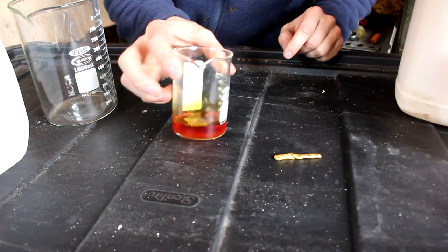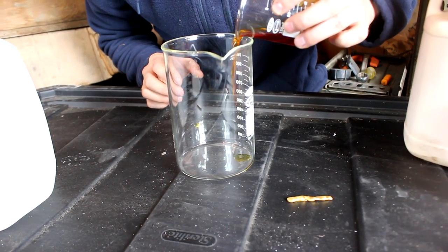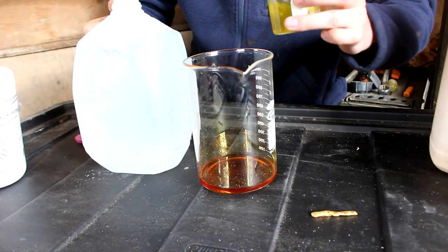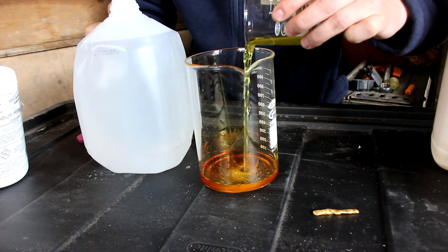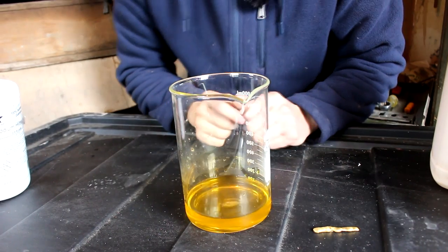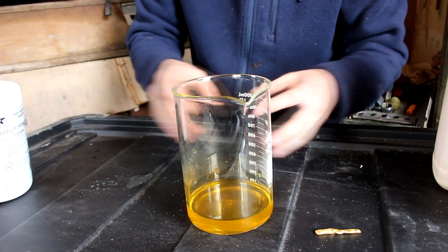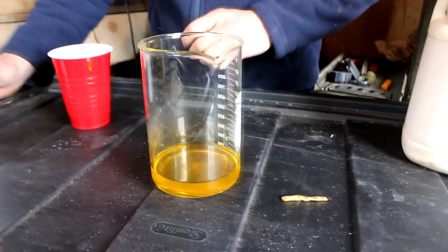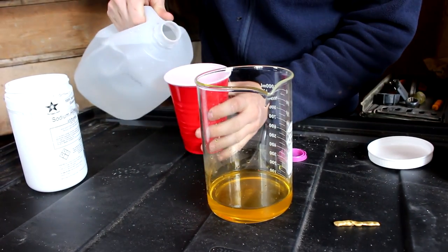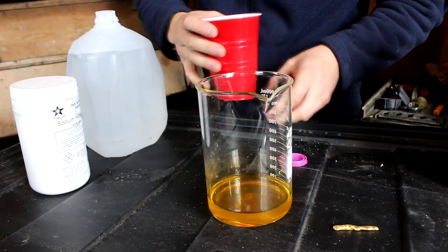Here's the solution — looks like it's mostly all dissolved. I'm gonna pour it into the larger beaker and leave behind all the sand and stuff, then rinse this out with a little bit of water. Now we've got to get the gold into a form that is usable for electroplating. I could electroplate with this, but it would form gold that wouldn't be a flat layer — it would just kind of bunch up into gold crystals. So I need to convert this into a cyanide solution, and one way to do that is to neutralize it and form gold hydroxide. Doing it this way, I don't have to evaporate the solution down or turn it into a metallic powder.